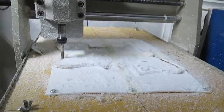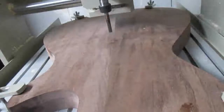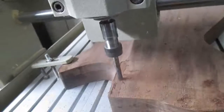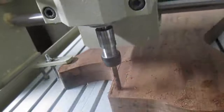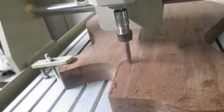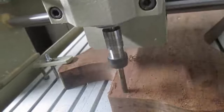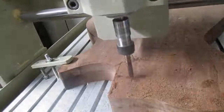Here's a piece of black walnut. Interestingly, this machine does better with black walnut — which is fairly hard and fairly dense — than it does with pine. The pine I did had a lot of chip-out and rough edges. You can sand those off, but less sanding is better — that's part of the reason you use a CNC. With pine there's a lot of tear-out and chip-out, but with black walnut you just have to adjust the feed rate and everything comes out pretty smooth.